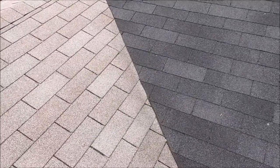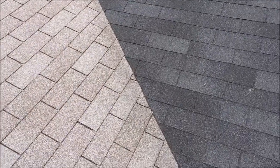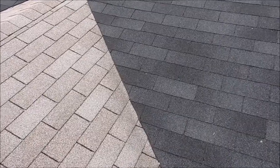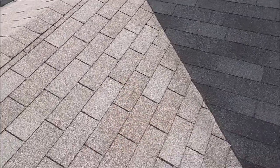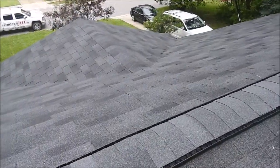When we install the new roof, we're going to have to take off one course of shingles here so we can run ice and water shield right along the entire length of the valley, and then the new shingles are going to be tied into this roof. There are also two more valleys over here where they did exactly the same thing.